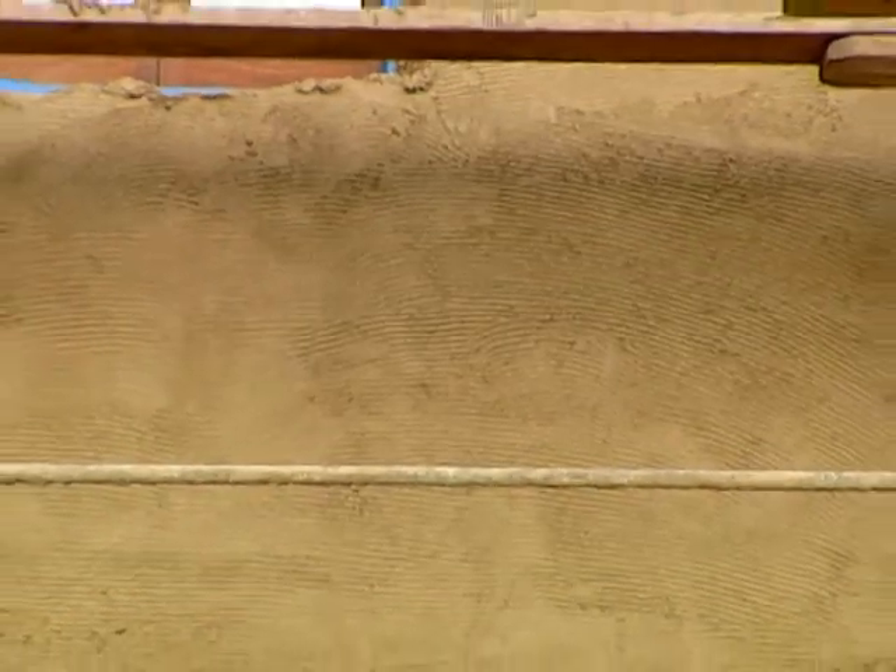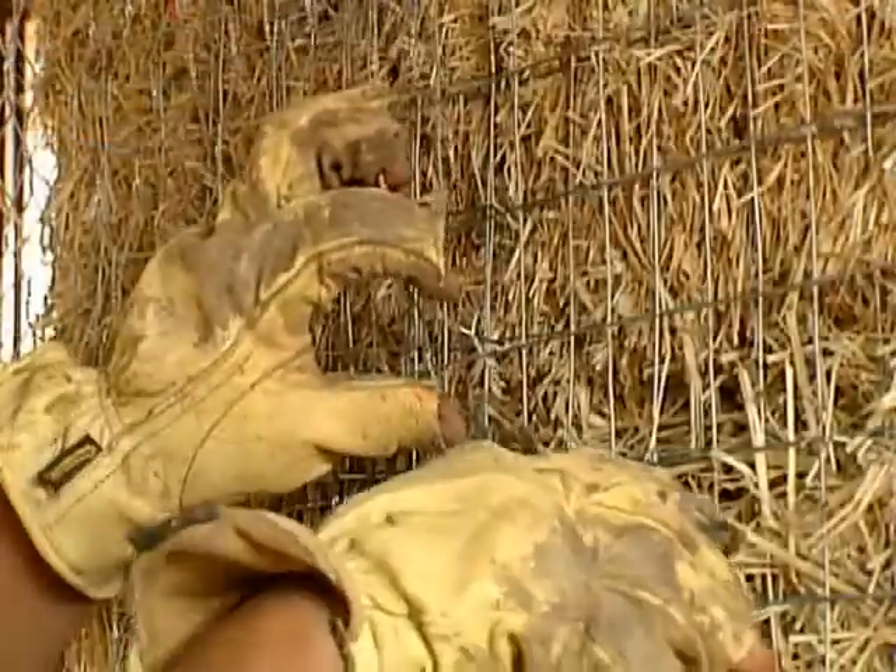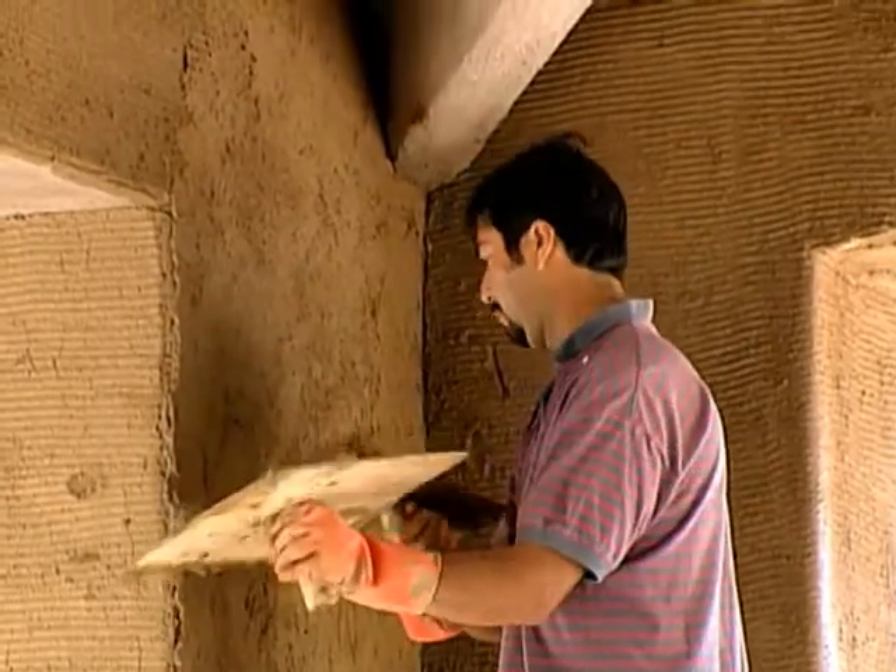Today's challenge is to cover our interior walls with the healthiest products possible. Where we paint, we want to find a natural, no or low VOC paint that won't outgas harmful fumes. Where we plaster, we need to find a product that will work with our exterior earthen and lime plaster to create a wall system that is completely breathable. So today we're talking plasters — the skin of the building. Our straw bale walls are our exterior envelope, but on that we have to put a skin.